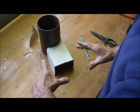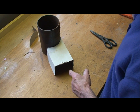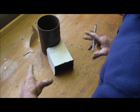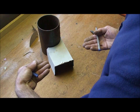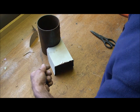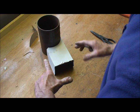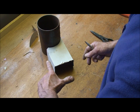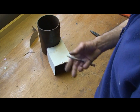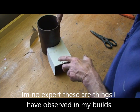More questions on the size of the opening on the top of the firebox — mine has a glass lid, so to a certain extent the flame is contained and the air intakes come in at the sides at the top of the firebox, as you can see in my previous video. You can get away with a slightly bigger entrance to your firebox if you've got some kind of lid on it. If you're not going to put a lid on, then you really have to have an entrance to your firebox the same size as your riser, because it's all about the volume the riser can pull through — they need to be equal.